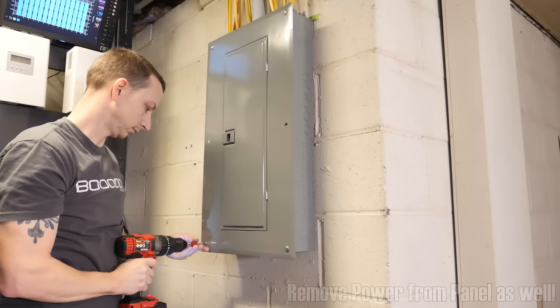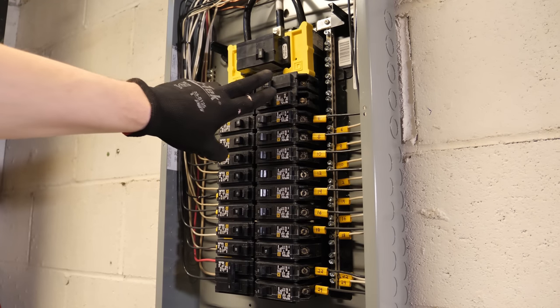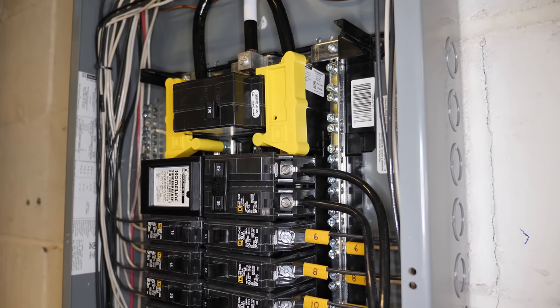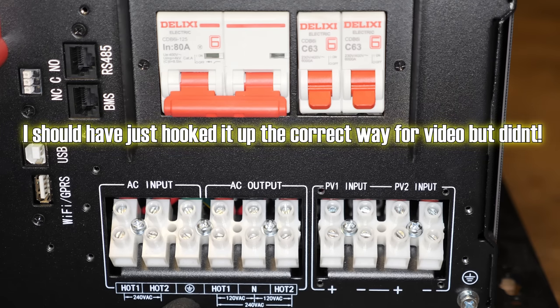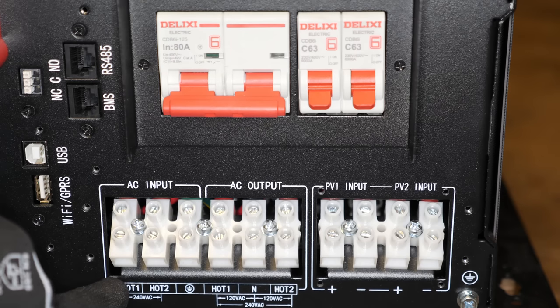Remember, I'm not a licensed electrician, so if you're not comfortable working inside a breaker panel, seek advice from a professional. Next we're going to hook up to these two circuit breakers on two separate phases — hot one and hot two — and those are going to go down to the inverter. Also connecting hot one and hot two from my main circuit breaker panel. Normally you'd hook up the ground wire back to your main panel ground-neutral bond, but today we're connecting the ground directly to the test box. Make sure your circuit breakers are in the off position before you start.